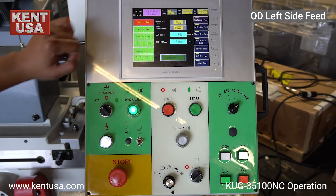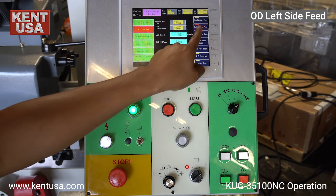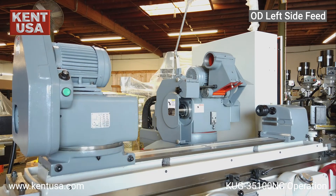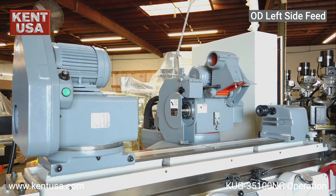Now we will demonstrate left side feed. Notice how the grinding start point changed. This value is unique per grinding cycle and it can be set the same way as shown earlier for continual feed. We see similar parameters needed to use left side feed. Only in this case, there is hydraulic table movement and the grinding wheel feeds in on the left side. Now we can click cycle start. Once the cycle finishes, the machine goes back to a retract position of 3 inches.